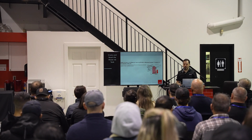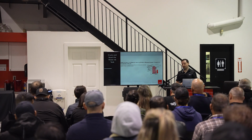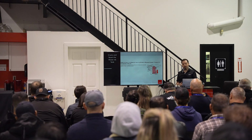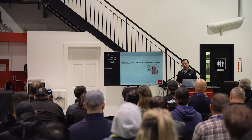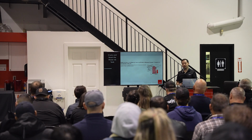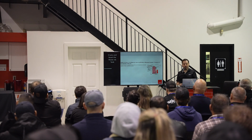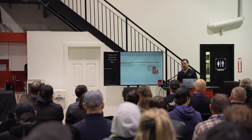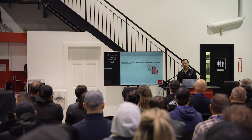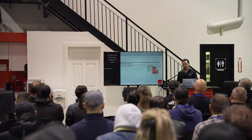The machine's on a timer, so when the machine is installed, it knows it's empty. And as it goes through its cleanings or printings, it adds up the amount of ink in there. When it's at about 80%, it's going to warn you and say, take a look, it's getting pretty high. Once it's at 85, it's going to say you need to empty it out before I continue printing. So essentially, you want to go in and empty that.